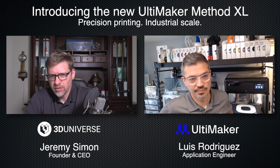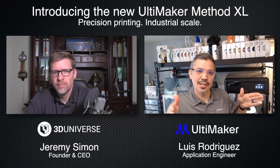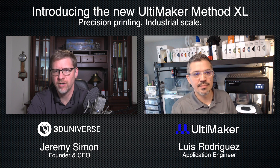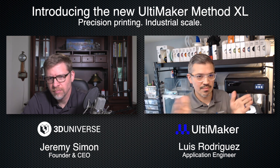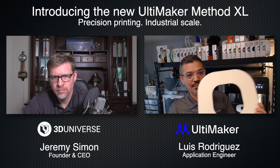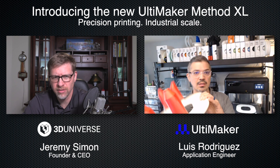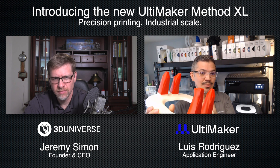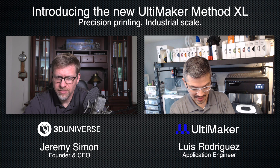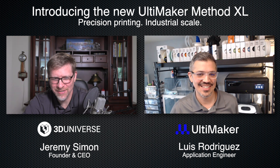So you're getting basically a cubic foot of build area. Without touching cloud print settings, that's roughly a 300 mm cube — the raft takes a little off. I was able to set the raft to no margin and it printed great, so about 11.8 inches cubed. I actually printed a piece intentionally at 305 mm since they said you have 305 mm. For a large ABS part I'm used to cracking and lifting, but it pulled right off the base without issue. That's great. I'm very excited to start digging into the testing. Thanks for joining me today. Thanks, Louise — good talking to you.